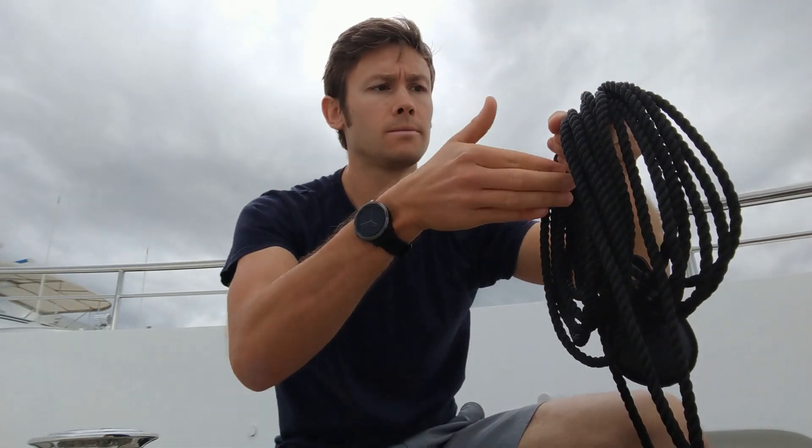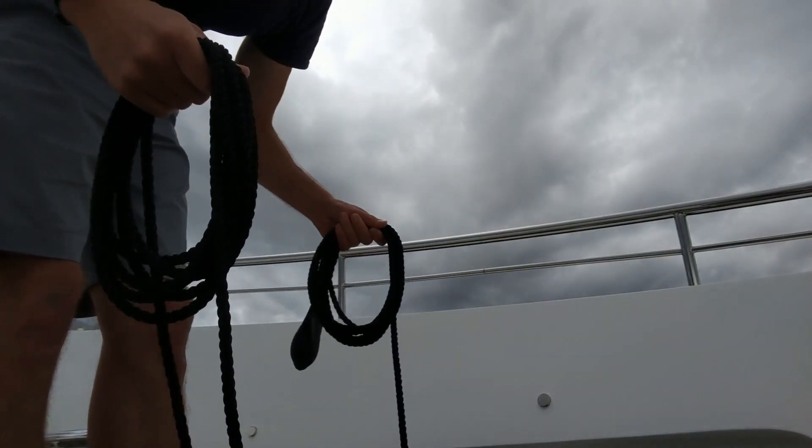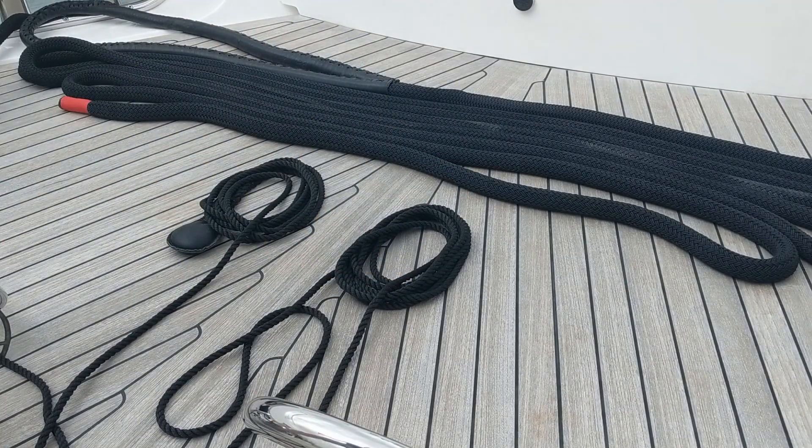You can now separate them at the long coil. The two coils can now be placed down neatly on the deck. You'll want to make sure that you set up your own heaving lines, because if somebody else does it how do you know that they've got it just right? There are often times when it is of real importance that lines are put ashore quickly. If they end up in the water or tangled up on deck it can cause serious problems for the captain.